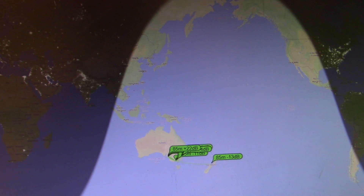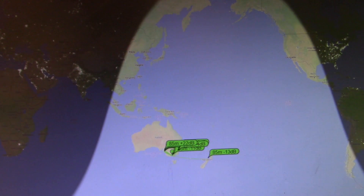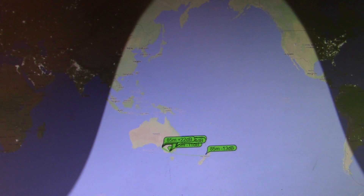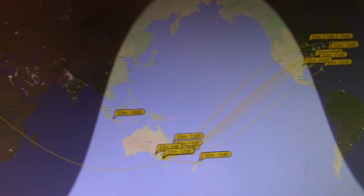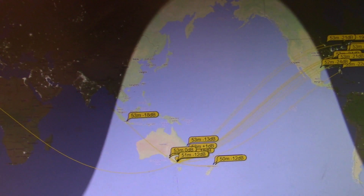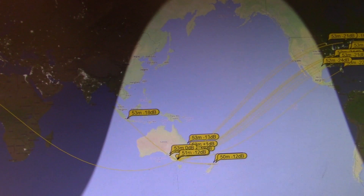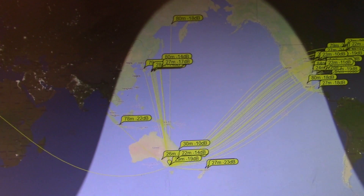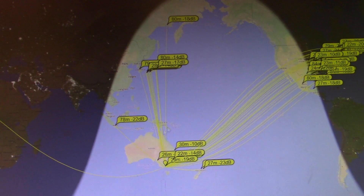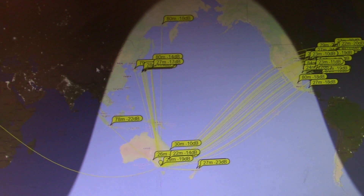Back home and a quick look at where my signal was detected. On 10 MHz — no contacts there, I wasn't on for very long. On 14 MHz, signals across the US and a little bit of North Africa, but again I wasn't on for long and no contacts. On 17 meters I was on for quite a long time, detected a lot in the US but no contacts there — however, quite a few contacts in China and Japan, so 17 meters was very successful.